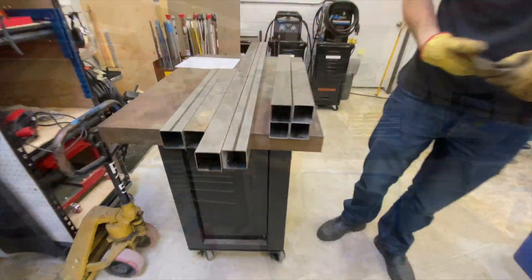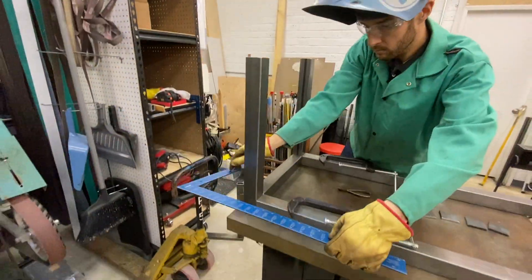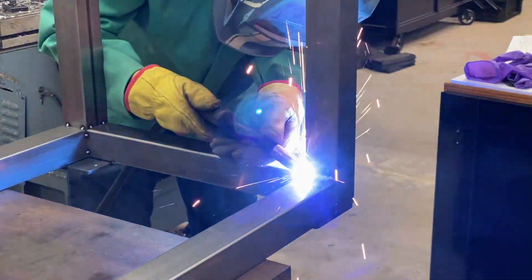What we're going to do is cut all the tube pieces for this assembly. We're going to use a belt sander to take the burrs off and give us the bevel for welding. Then we will tack it all together, double-check that everything is square and good to go, and then we'll finish weld it so it's ready for paint.